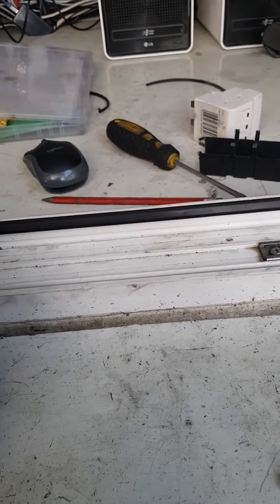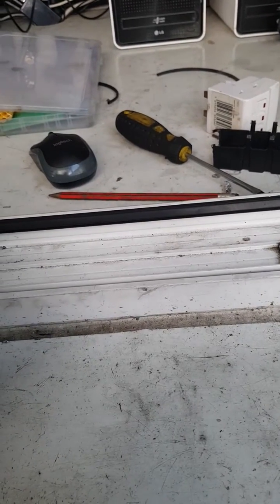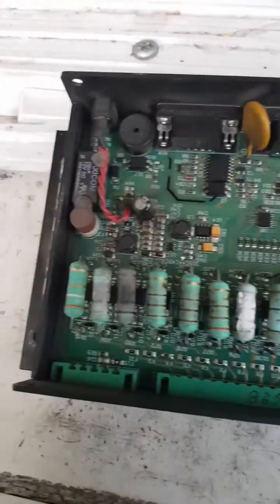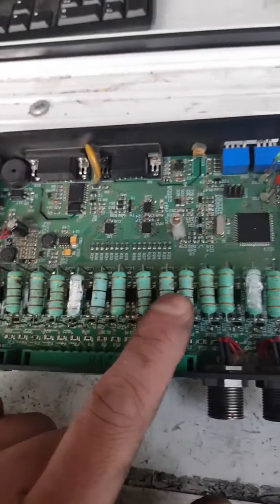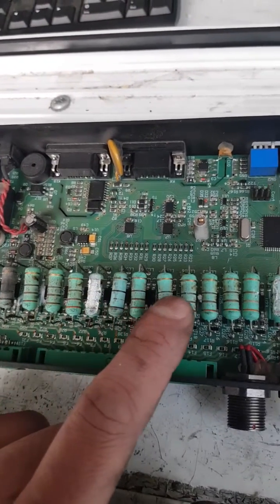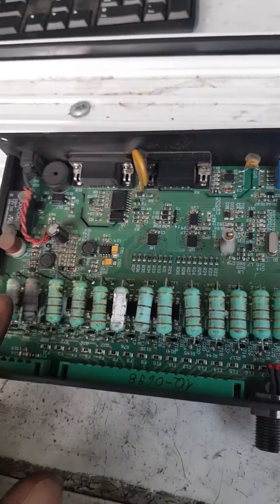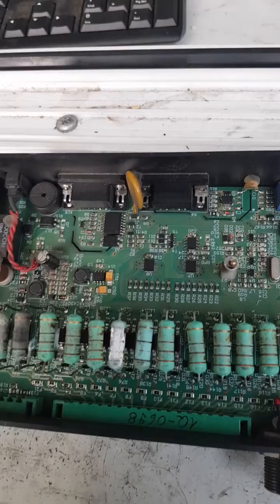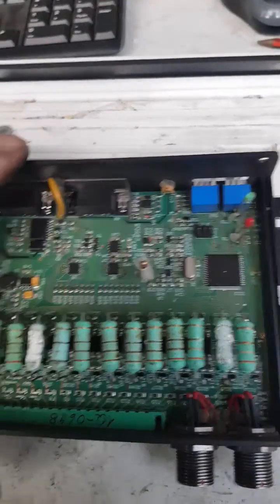There are still things I like about the REC BMS, even now. Excuse the heatsink goo, but there are still many things I like. It's been in service for over two years. We run it with the lid off, with a fan blowing on it. Just look at those resistors burning off the heat between the cells — they can all run at the same time. The amount of heat being burned off is ridiculous.